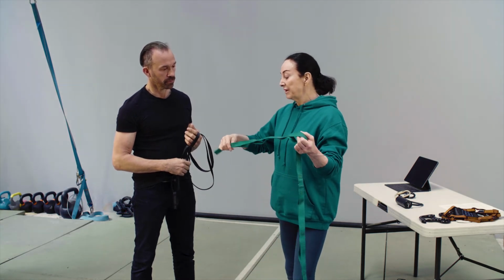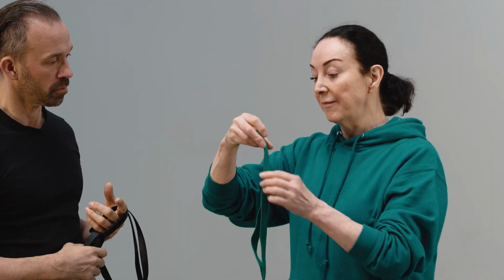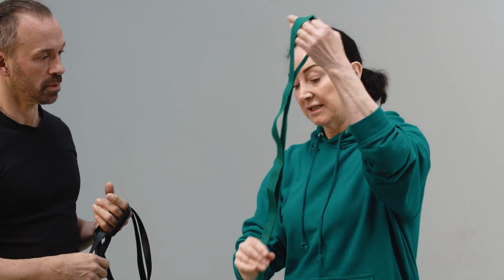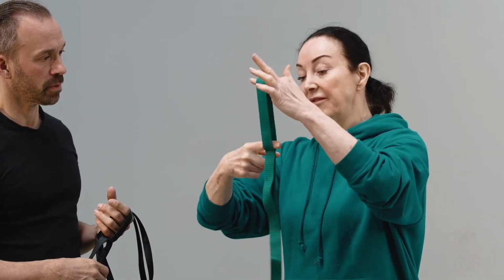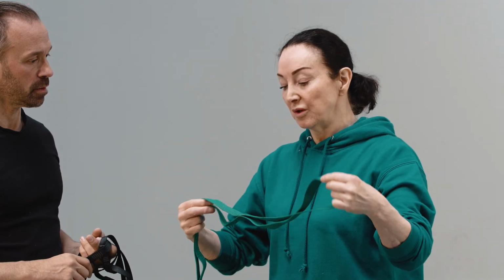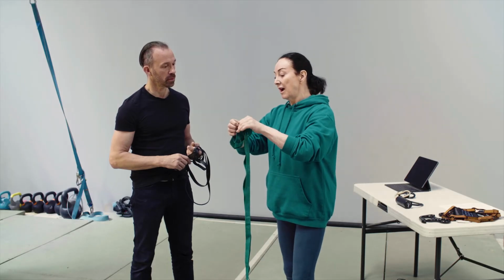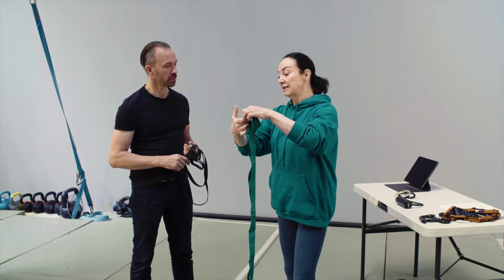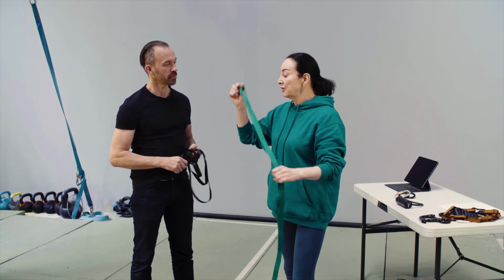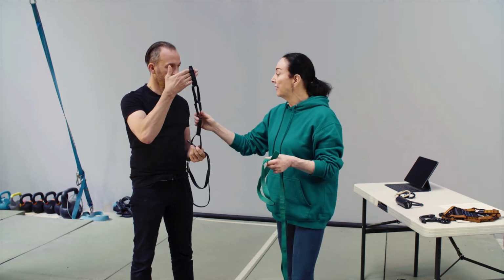One hundred percent. There have been some accidents with this because people rig it wrongly. When you're on it, it's actually one piece of material that's divided into loops. If this gives, granted in normal circumstances you would just go down until you reach the end loop, but there are some circumstances where people don't use the whole thing and they fold it back on itself and hook it on. In this circumstance, if this gives, you actually end up with the carabiner coming completely out, and you're not attached to anything. So it's best to avoid these and stick with either the one that's got the individual loops, a climbing sling, a strop or a round sling. Lifting round sling, very good.